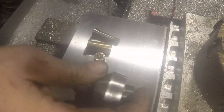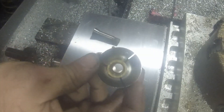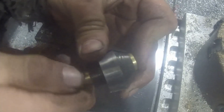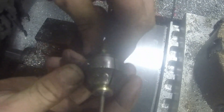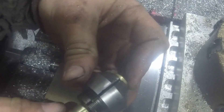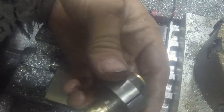Here's all the pieces. This collet can be changed for different size material by simply unscrewing this piece on the back. You should never have to remove the brass adapter from that nose cone. I had to put a little pin in there to keep the collet from spinning, but the tighter you go on that nut on the back, the more the collet compresses down on the stock.